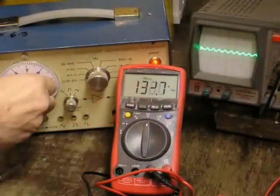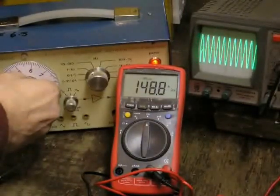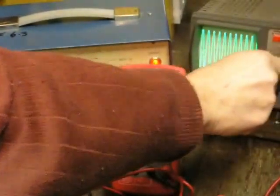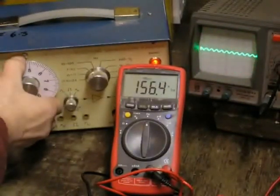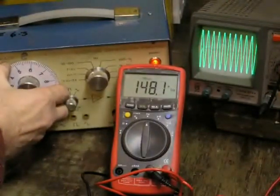So I'm starting at 130kHz and increasing the frequency while watching the scope, looking for a peak. Now we have something here — let's just enlarge that. Now if we increase the frequency it drops away, so we know we have resonance at 148kHz.